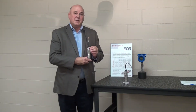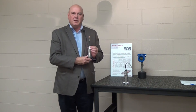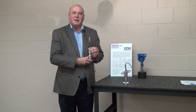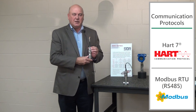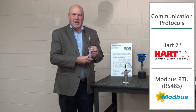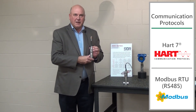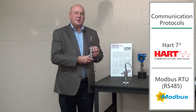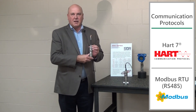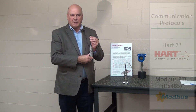A fourth advantage of our pressure transmitter is the selectability of communication protocols. In our 815PT we have given you the selectability of both HART and MODBUS. Our transmitters can be calibrated, diagnosed, and reprogrammed via HART and/or MODBUS — we leave that selection up to you. It's a simple matter of how you wire our transmitter.